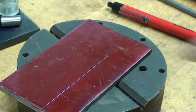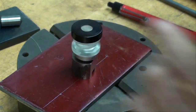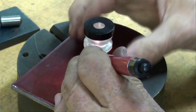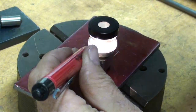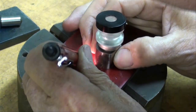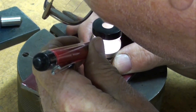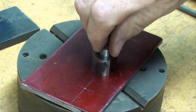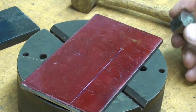Now for this other one, I've got a line there also. Let's use the optical center punch — we'll put the magnet on there and the little eyepiece. That's my light source. Right in the crosshairs, like my Marlin gun. Pull the magnifier out, put the center punch in, hit it with a brass hammer. And we hope we're right on.